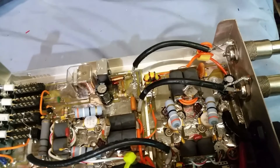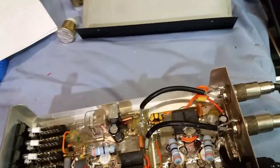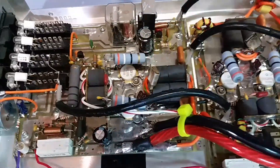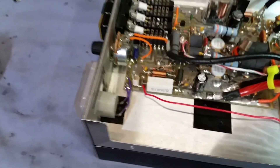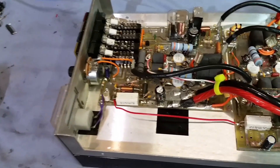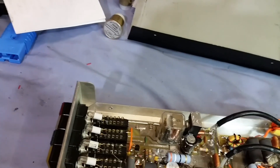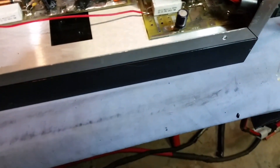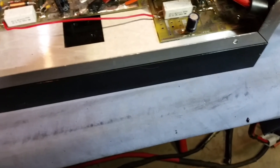I went ahead and matched four 300–330 picofarad caps from collector to ground. The four that were on there had taken a hit and were nowhere near matching each other, so I matched four new ones and dropped them in. I also put 243 beads on the power wire for a little extra inductive work on the power lines.